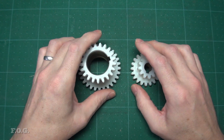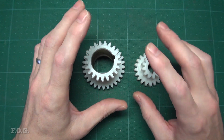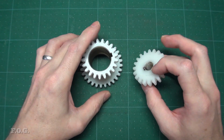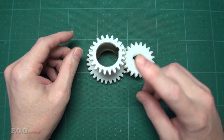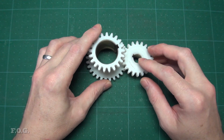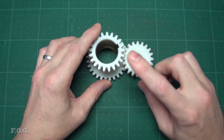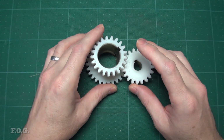So now on a different topic, but related to the gear swap out. After first installing the metal gears, I decided to run the lathe for a while to try to wear the gears in a bit. Unfortunately, I'd messed up reinstalling the gear change lever. This meant that the gear lever was not locking into its ball indents correctly. So after about 5 minutes of running, the gear lever attempted to switch itself into the high gear, causing everything just to lock up suddenly.